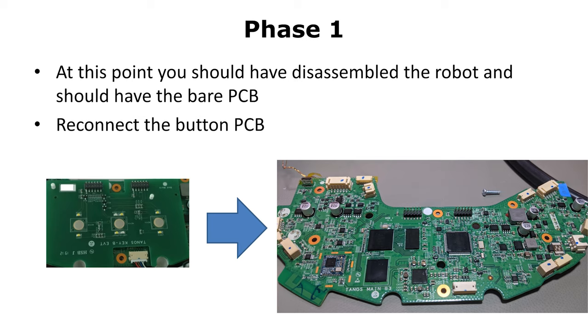In this step, you want to set up your computer for the serial connection. You need to know where the RX and TX on your adapter is. For some adapters it's marked, but for others it's just a particular color of cable. In my case, the white cable was RX and the green one was TX. But don't worry — you cannot damage your robot if you have it wrong. Set your UART program to 115200 baud and disable flow control. This is very important. Finally, you want to test your settings by connecting the TX and RX of your adapter together and typing something — you should see an echo. This is what we call loopback.